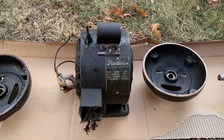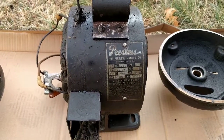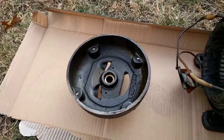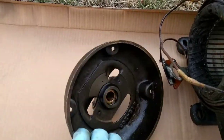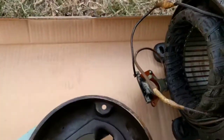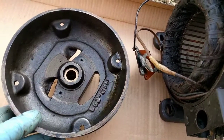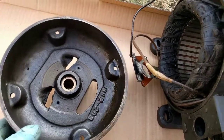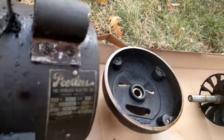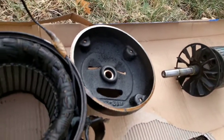This is a 1950s peerless motor from my 825 Logan lathe and as you can see it's covered in 60, 70 years of oil. Part of the problem is that this is a bushing motor versus bearings and it actually has a felt piece inside that retains the oil for the bushing. Obviously if you over-oil it, it's going to leak in there anyway, as well as the capacitor fried on it and leaked oil all over the place. So I'm about to clean it off and put it back together and see what happens.